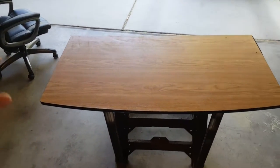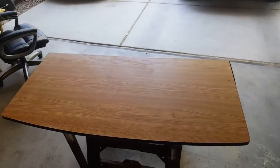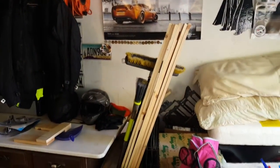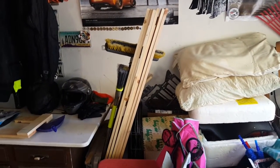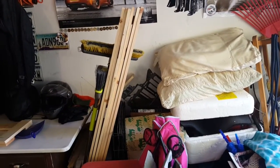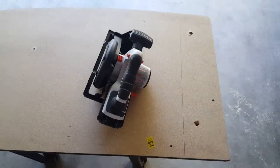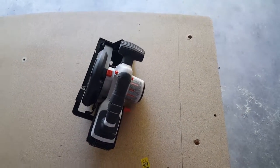I'm going to remove all of that border. I'm going to paint this anyway, probably black, so the laminate top doesn't matter. I'm going to remove the border and cut five inches from either end. Then I'm going to use some leftover wood that I got from making a gate to build some kind of L frame brackets with an angle on them to hold the desk against the wall. I've already found the studs in there so I'm going to secure them to studs in the game room. Cuts are made and right at 37 inches.